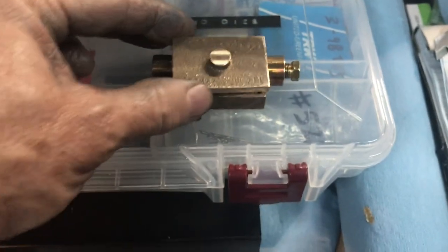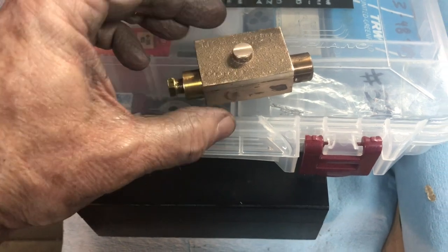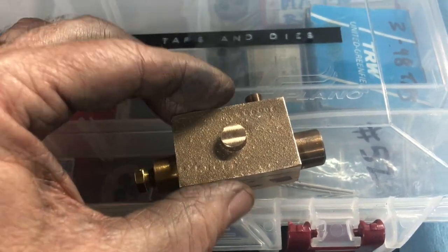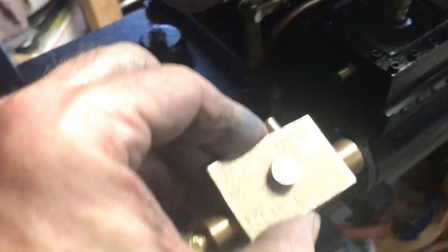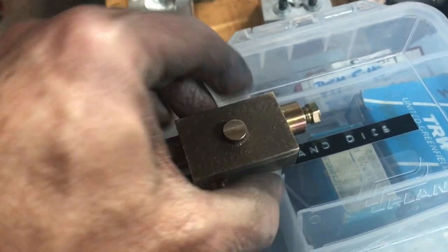Here's the steam chest cover for the steam chest — this is the one that I had to heat up and repair yesterday. It fits nicely. The little nub, instead of cutting it off flush, I thought it looked kind of cool, so I milled them down to 150 thou tall on both sides and I'm going to leave it that way. Like the Allen Mogul, it has a little boss there in the steam chest for the oiler. The LBSC Titch oil comes through in a different way into the steam supply, so I don't need those, but it looks somewhat authentic so I'm going to leave it there.